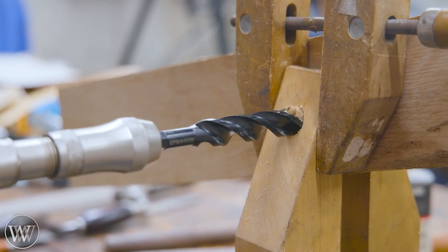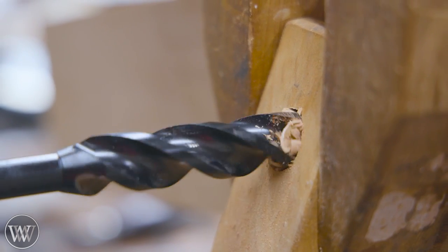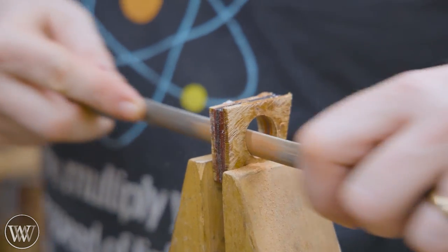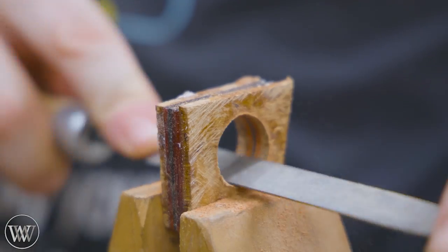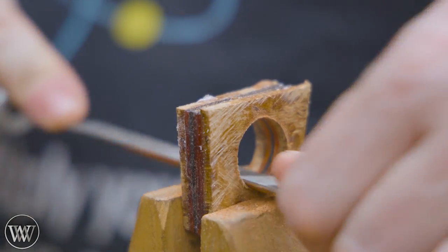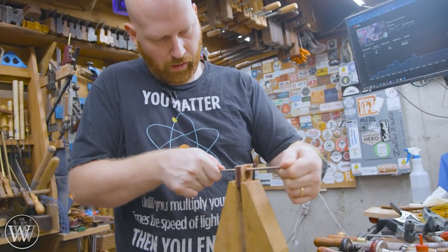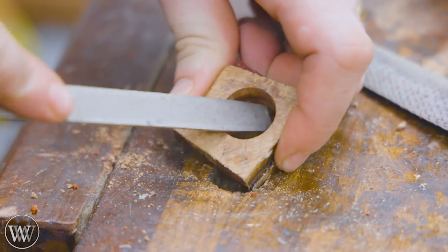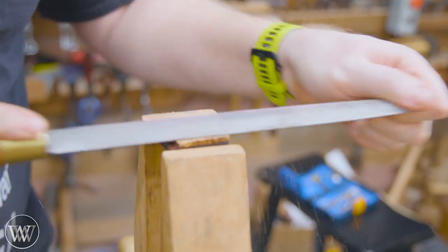You'll live and you'll learn. We just keep on going through this taking it nice and slow — not chipping anything out, letting the blades do the work. Once we get all the way through, theoretically we have a hole going through the middle that's just a little bit too small. We can come in with a file and open it up until it's really close. At this point you could try and fit it onto your finger, but you want to make sure you round over the edges first — you don't want sharp edges on there, otherwise you're going to have a hard time getting it off.